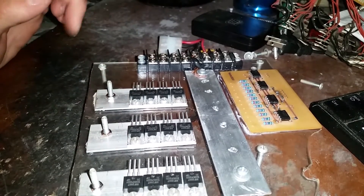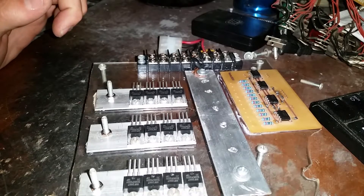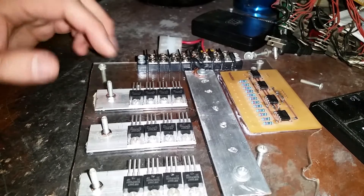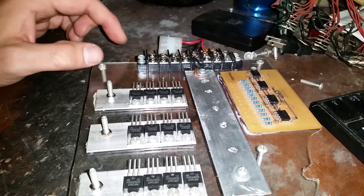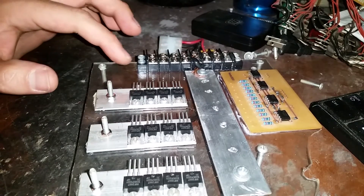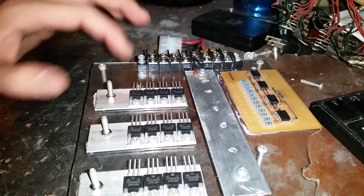The power part — you would have power going into the alternator, a positive, anywhere between 5 volts to 50 volts is what I'm figuring this will work out to. At 10 volts, you're looking at needing 250 watts going through here, so this will handle that pretty well, just for experimenting.